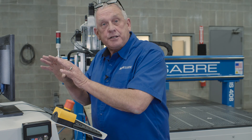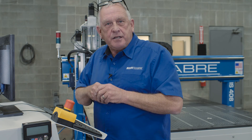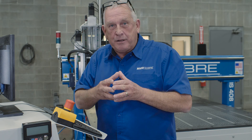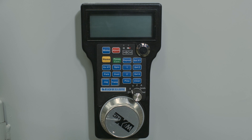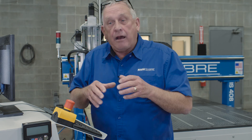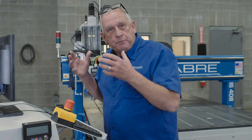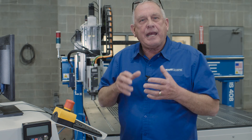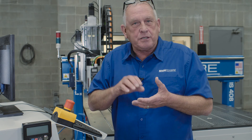If you like a touchscreen, we also offer a resistive touch touchscreen — and it's really important to use that style touchscreen for safety reasons. One of my favorite options on this machine is a wireless handheld pendant because it really makes it easy to set the machine up. Machine control itself is built on robust technology from Mitsubishi — MMP stands for Mitsubishi Motion Platform.